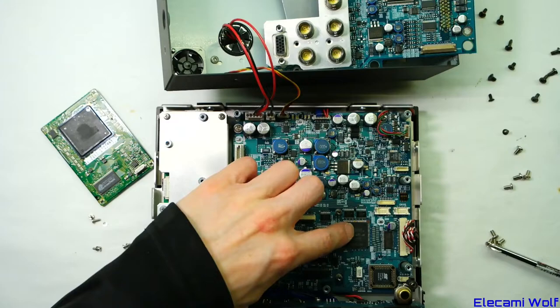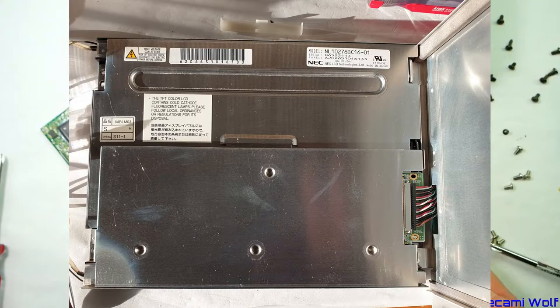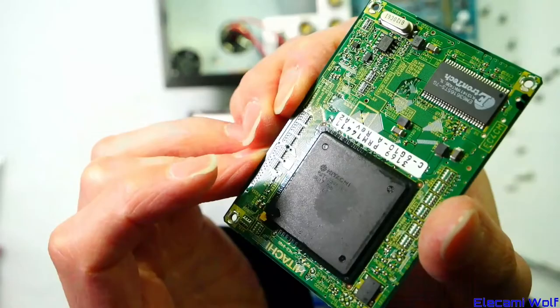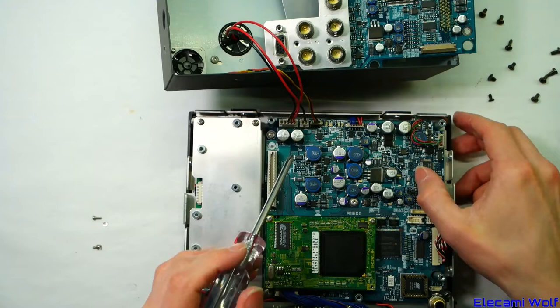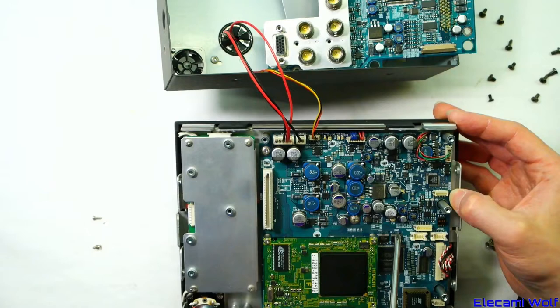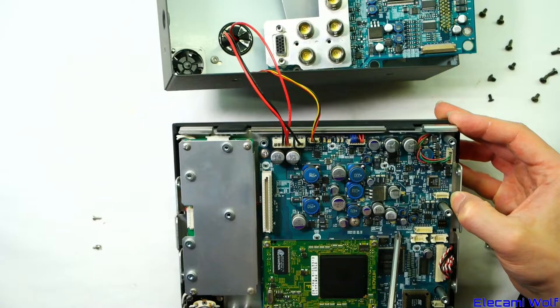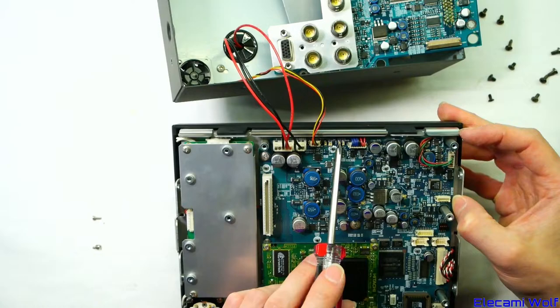That's a lot more processing than in the Sony monitor. The board has quite a few LEDs indicating the status of different power supplies, plus configuration jumpers and DIP switches. The silk screen notes include EL311 and EL312 for selecting whether it's a 5V or 3.3V LCD. Two LEDs indicate whether the battery type is NiMH or NiCad, for when batteries are mounted instead of the power supply.